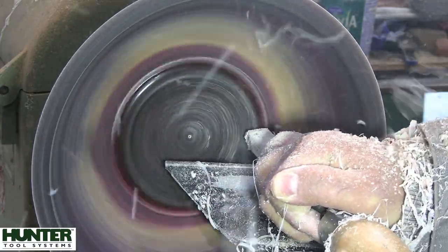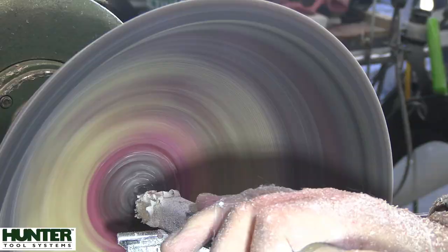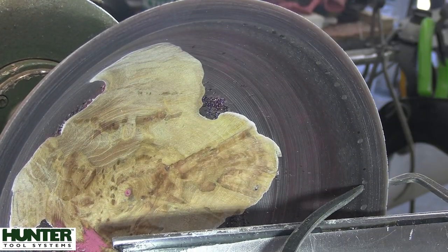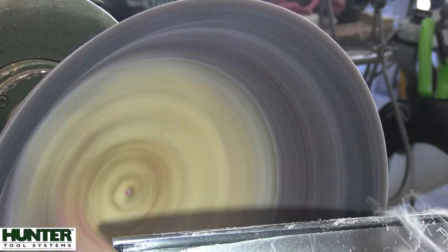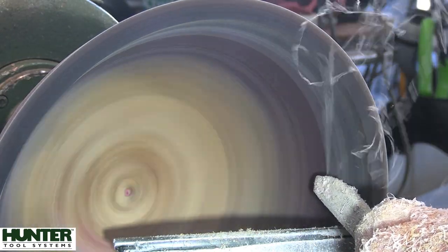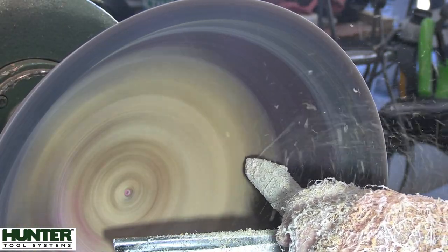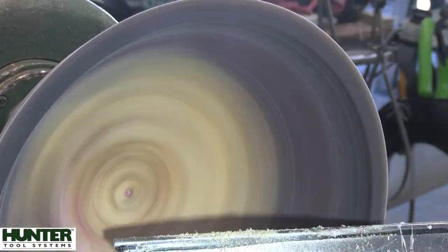The underside of the smaller bowl is concave so it has a habit of leaving a little pool of resin on the center of the bowl. Usually that's okay because I've got cracks I want filled down in that area anyway. But in this case it was a pretty clean casting other than the fact it was shaped really really strange. Always measuring wall thickness - always important. In this real-time clip I am cutting above center and the Hercules is probably at 45 degrees with the tool handle just down slightly - this gives you a really clean cut on the inside of the bowl in the belly area, which is typically one of the harder areas to get right.